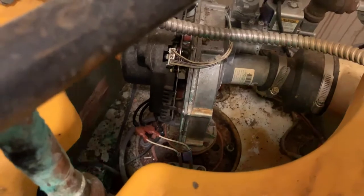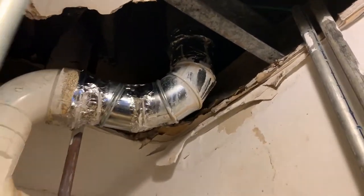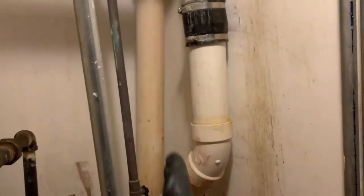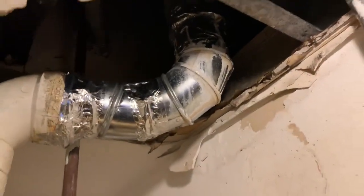This AO Smith Cyclone has seen better days. Look at how they did the vent piping — four-inch smoke 90. That needs to be PVC all the way up and out. That is a hack. We're gonna have to address that.